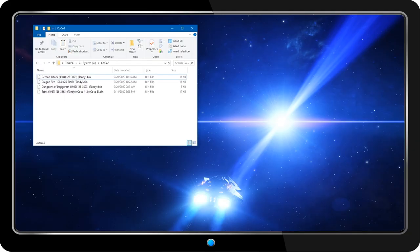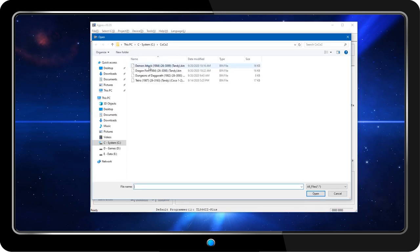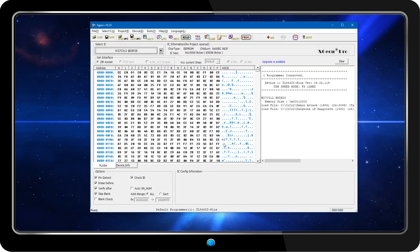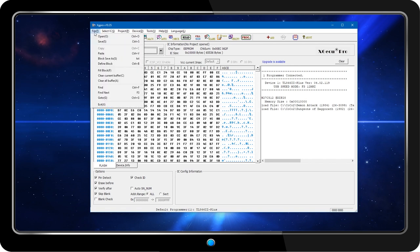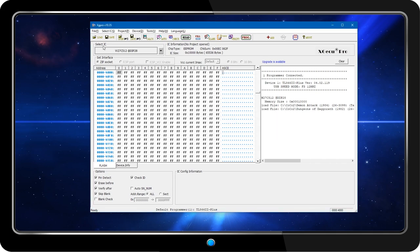That done, I'll need to assemble all the bin files together into a single 64K block. The converted files are of varying sizes, so they won't cleanly concatenate with a simple copy command. There are several options here, including using a hex editor or the Linux DD command to pad out the individual files, but the easiest method I found is just to load each image into the EEPROM burner software's buffer in their correct address space. The operation is straightforward enough.